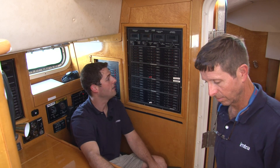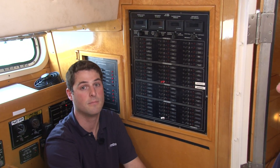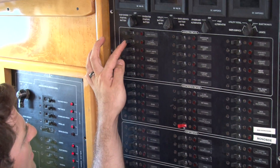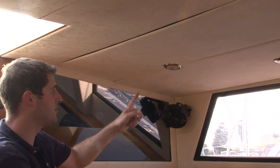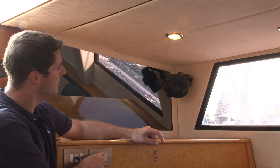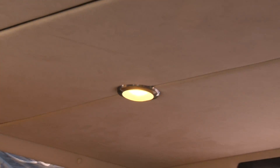We've installed all 14 lights now — didn't take us too long, probably not much longer than it would have to change all the bulbs. Anytime you're working on this wiring, make sure your DC circuit is off and there's no DC voltage where you're working. We're going to turn those circuits back on and see how they work with dimmers. With DC power on, we'll test this light with the existing dimmer — at full bright it seems to work pretty well and it dims down okay too.